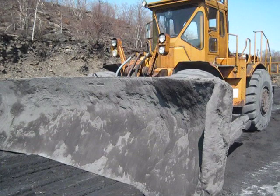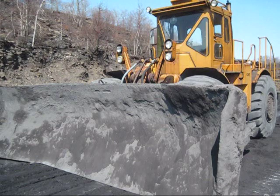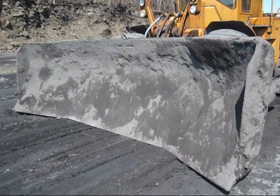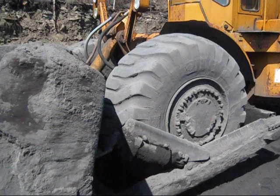This 824 is used for backfilling. Its job is to push fly ash around, which is the reject from a cogeneration plant, to backfill a stripping pit with. This is all part of mine reclamation, and because the material this dozer is pushing is very lightweight, the blade can be larger. This is a semi-U blade, which is much larger than the standard straight blade for this dozer.